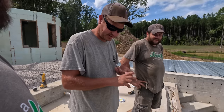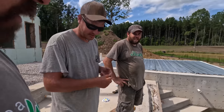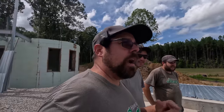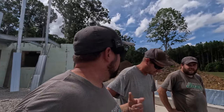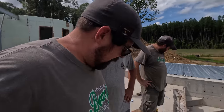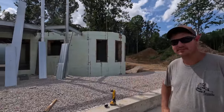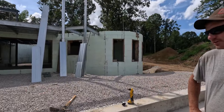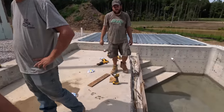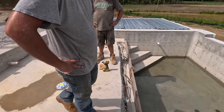Don't use that. Don't use concrete that's got pea gravel in it - use concrete with regular gravel, correct aggregate. If I could get the trucks to come in the correct order at the correct time, I could have put in a truck for that. What is the reasoning for using the small gravel in the walls instead of the regular? Better consolidation - that's really it. And we should have just run the rebar - it needs to be within two inches of the edge.